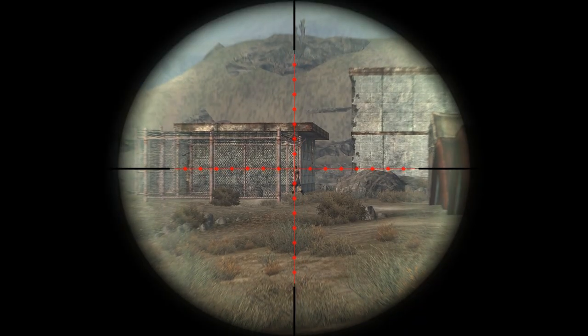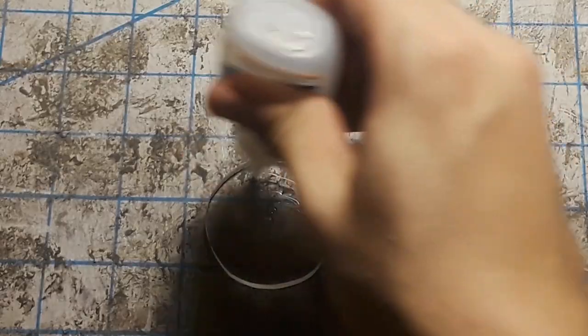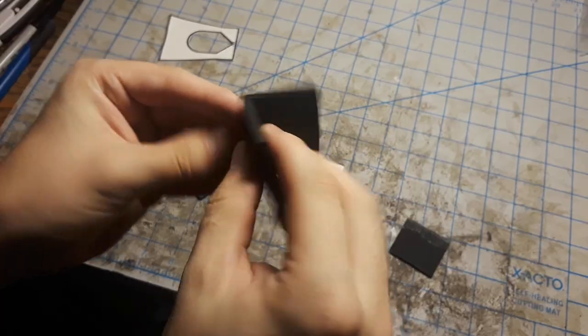There are also short cylinders on each end of the scope, and both those pieces have a little piece of acrylic in them. For the back of the scope — the one you actually look through — I was able to just buy a disc of acrylic and glue that in there. For the bigger front one, I bought a sheet of acrylic and cut it into a circle. For the crosshairs, I had to make them entirely from scratch using Photoshop and the pencil tool, then print that on clear plastic film. I cut out the printing and then very foolishly super glued it to the acrylic.